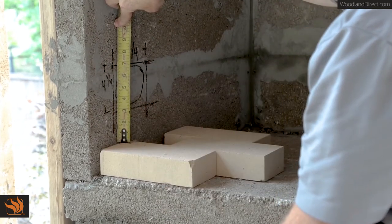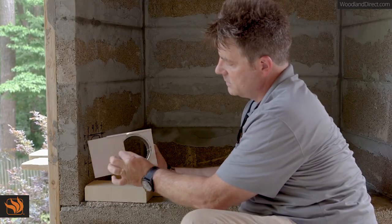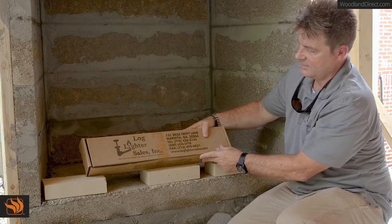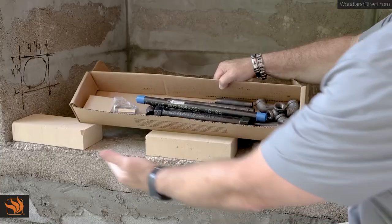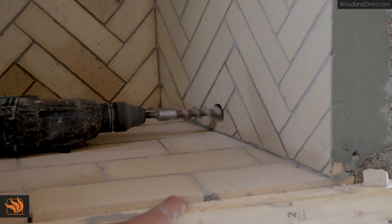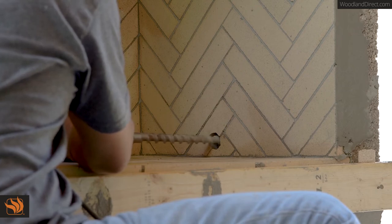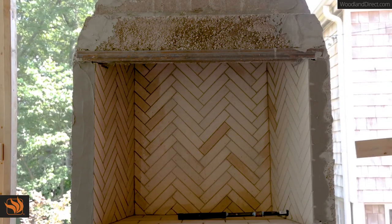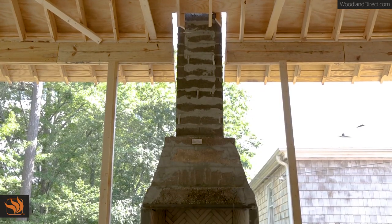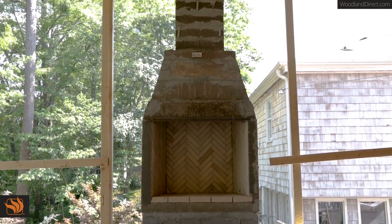Make cuts in the side block walls prior to installing fire brick, following manufacturer instructions. A licensed HVAC installer should run the pipe. Log lighters are another popular accessory that can be purchased from your Fire Rock dealer. They are available as flush mount, installed before fire brick, and top mount, installed after fire brick. Follow manufacturer's instructions for assembly and consult a licensed plumber to run the gas line. If you have any questions, feel free to call us or visit us online.